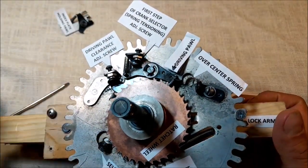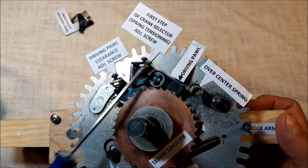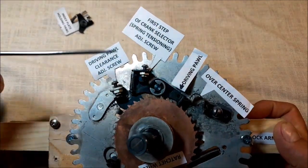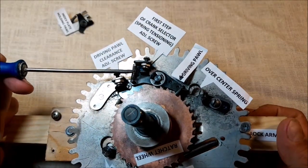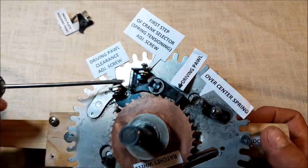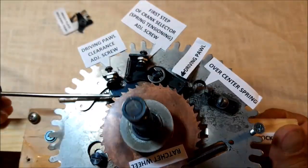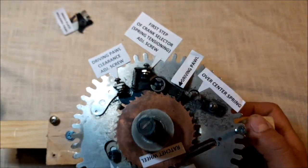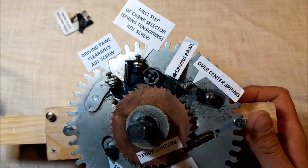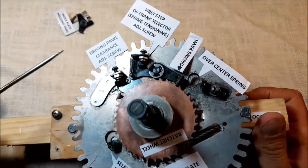So actually it looks complicated, but there's quite a range and freedom in adjusting these two. And the machine works quietest at the point where we have this spring here as short as possible. But don't go too far because you'll ruin the setup. Finally, you go to the point where this part just touches the wrist. Fine. Let's focus. So I will leave you for a while with these two to adjust it.